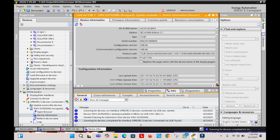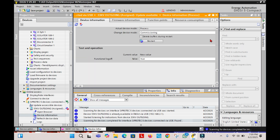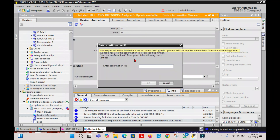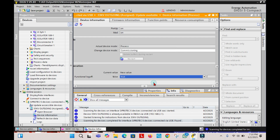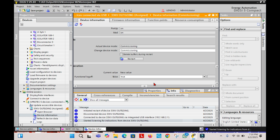Now scroll down to the Device Mode, and here you have to click on Restart to put the Relay into Commissioning Mode. Here is the Restart button, and again we have to give 6 consecutive zeros as the password. Now you will notice that your Relay display is showing the Commissioning Mode, blinking that message that the Relay is in Commissioning Mode.